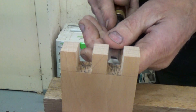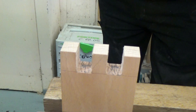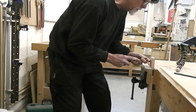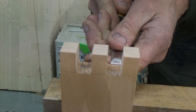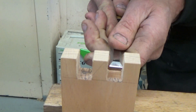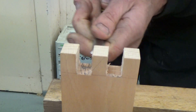I've changed the piece in the vice and I've also put some pencil marks on to help you see where the cut's happening. The high point is about there on each of these, so now I'm going to pair away. It's a similar principle to when we were paring cross grain: I've got my elbow tucked into my hip and I'm driving the chisel forward by pushing my body forward. I'm just placing the chisel on that corner, not taking it any further down because we've got that reference from the knife line. You can see how the high point is moving further and further back each time. You can use this sort of technique when you're paring out between dovetails as well.